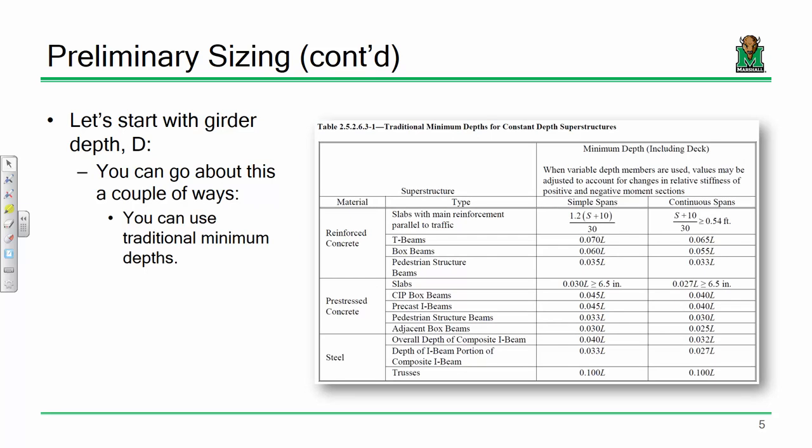based on your span length, how deep a given element is. For instance, if I'm talking about a steel superstructure, the depth of the I-beam should be the span length times 0.033. If we're talking about the overall depth of the composite beam, it should be 0.04 times the length. So that can give you an idea of about how deep the beam ought to be,